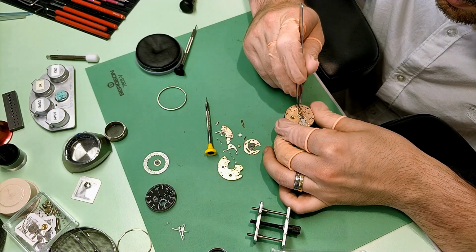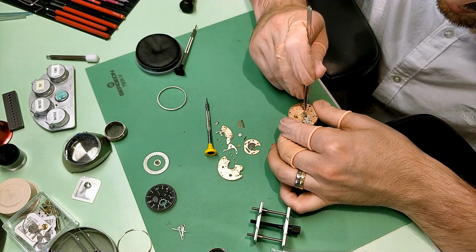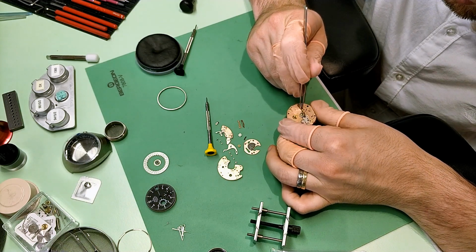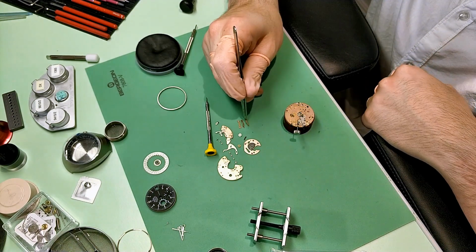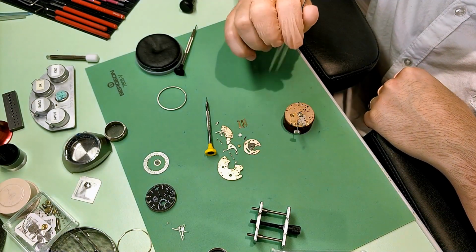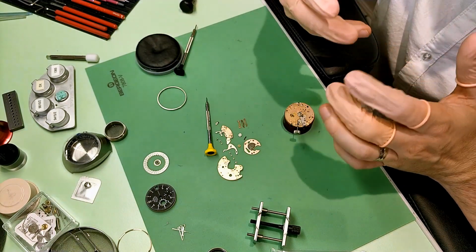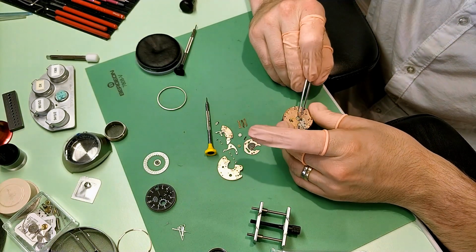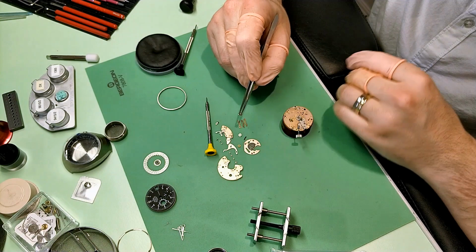And for this system, I don't put any grease or anything. What is good with the bronze is you don't need any grease. If you put grease for protecting the material, then you will remove the property of the bronze, so it doesn't slide. It's not good. So it's gonna get sticky if you just add grease.